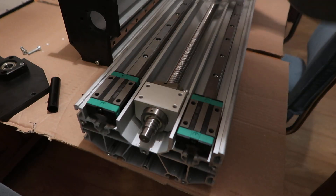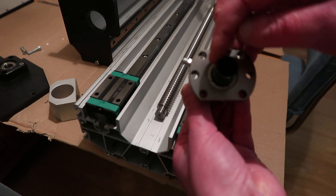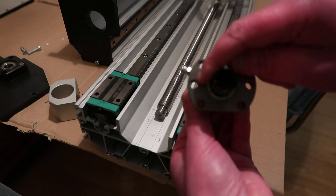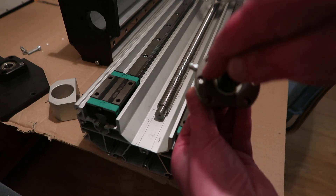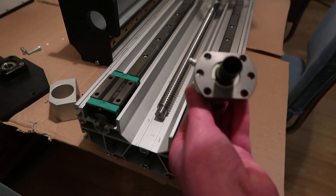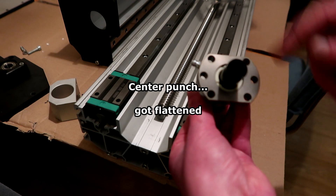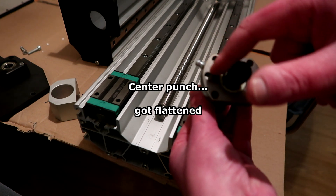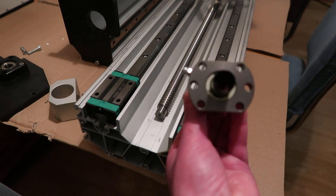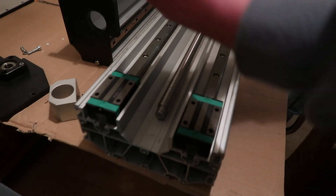On the original, the fitting is here and the hole runs from here to the races. I thought: the screw thread ends around here, so I could drill a hole, tap it, put the connector here, and seal the original hole. The problem is this part is hardened — my center punch did nothing at all, and my drills did nothing either. The only option I could think of was a grinding disk, but that's not working either. It's just a bad place to have it with this kind of profile.